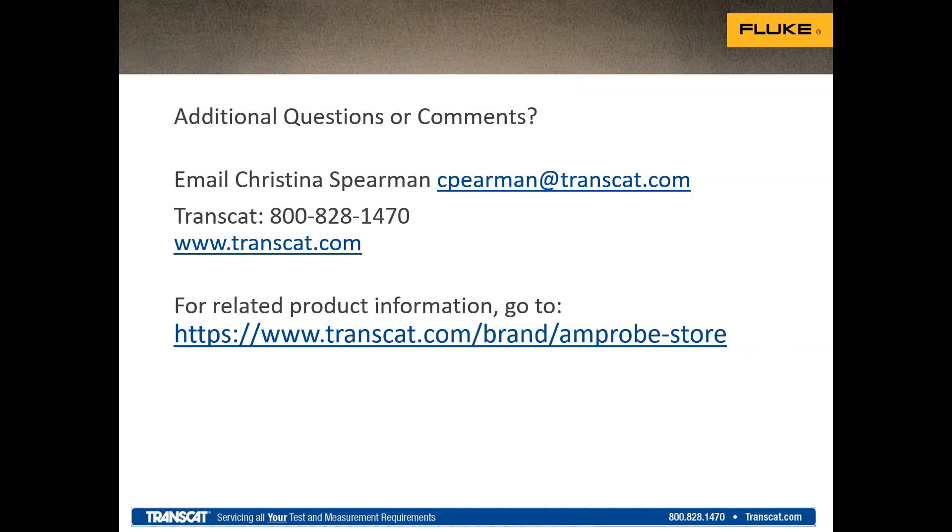Next question: Our solar application is around 1500 volts — does the Norma 6000 support this level of DC voltage? With DC voltage measurements for solar applications at that level, we do have the differential 1500-volt probe — the U1500S — so you would need that probe to do those 1500-volt DC applications, but we certainly support them. Next question: How many measurement parameters can you view at one time in the active display? You can customize what you see; the maximum number of visible parameters at any one time on the display is 20. It could be quite clustered looking at 20 measurements simultaneously, but you can visualize up to 20 at one time, and then page down to see more.